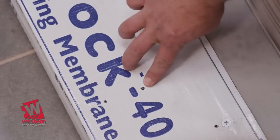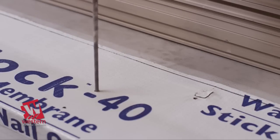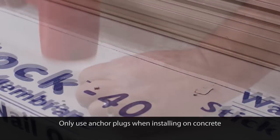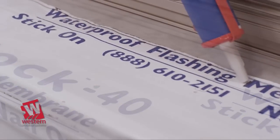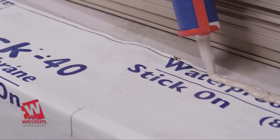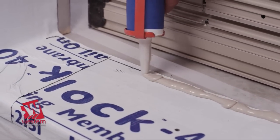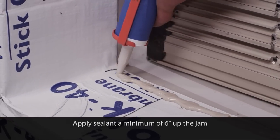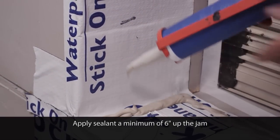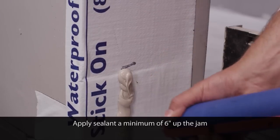Remove the threshold assembly from the opening. If the floor condition is concrete, drill ¼-inch installation holes at each marked location approximately 2 inches deep and insert one of the green plastic anchor plugs supplied. After that, apply a ½-inch wide by ½-inch high bead of sealant on the floor along the exterior side of the mark from jam to jam and from the inside corners across the end to the outside edge of where the threshold assembly will be. Continue the sealant a minimum of 6 inches up the rough framing where the jams will be installed. Inspect the sealant carefully to ensure a complete water barrier has been accomplished across the full width of the opening.